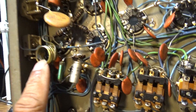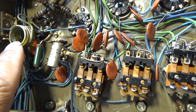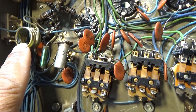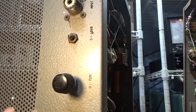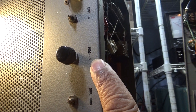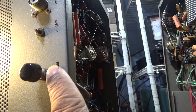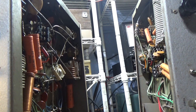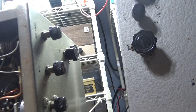That there is what I'd call the pre-driver input. On this KWD1000, your radio input would be tuned by this, and then these are the four baldy pre-driver tubes. On the back of this it's a little different because you have another set of tuning loads. You've got a tune and load for your four baldies. So the signal chain is: radio input tune, then pre-driver tune stage, then your driver tune, and your final tunes over here on the front.